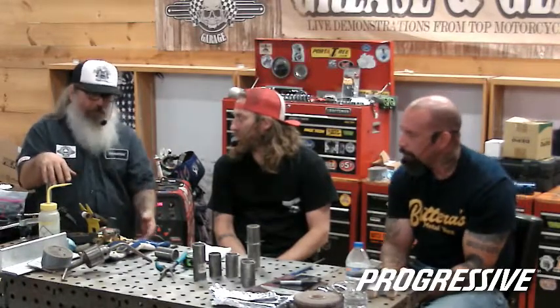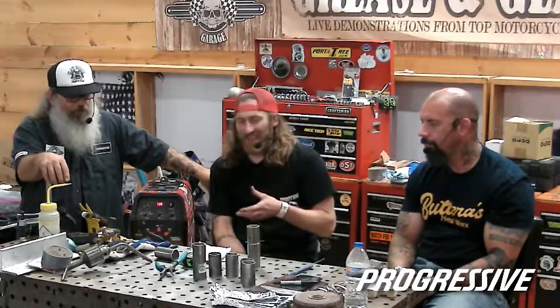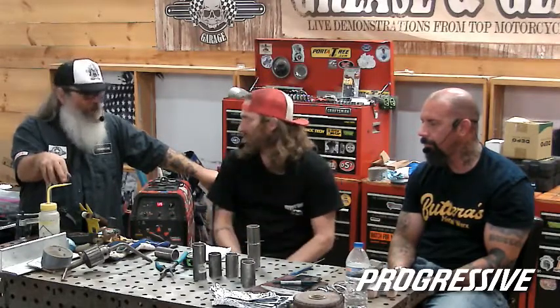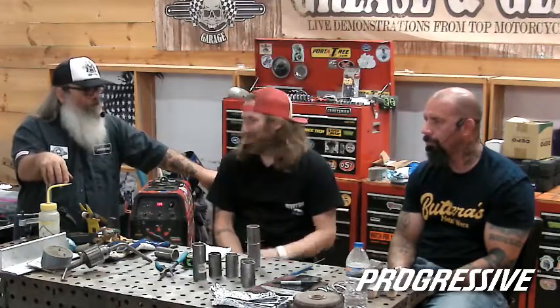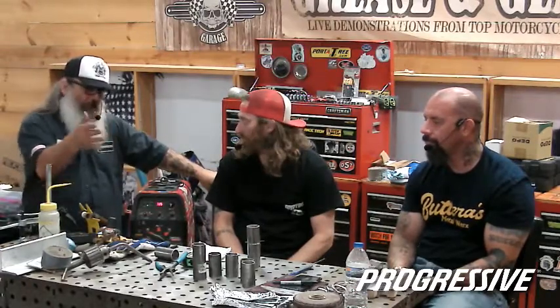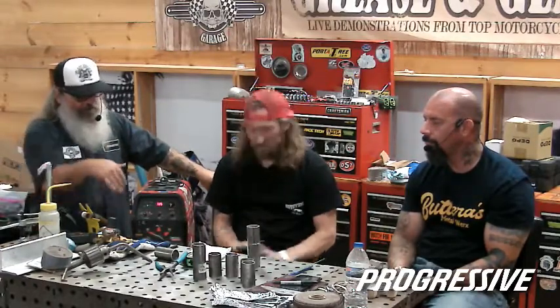You have to take steps and not get ahead of yourself, because that's the thing with TIG. Don't rush. It's about patience and learning and not getting discouraged, and it's not easy. If you rush, you'll just fight it. If you're not prepping your parts, it'll never weld how it's supposed to because you're not taking the time. People get anxious and don't want to sit there and Scotch-Brite pieces, but your finished product is only as good as your steps to that finished product.